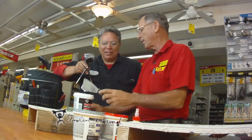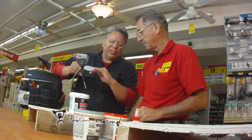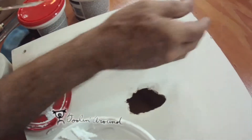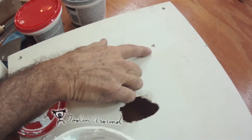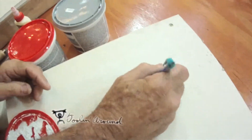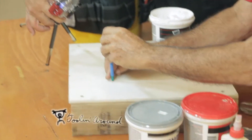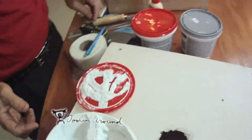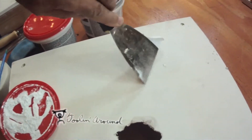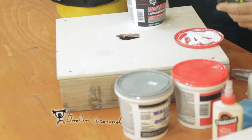If I was to go ahead and patch that hole, it would be a poor job. Because when the screw was removed, there is loose paper. What is recommended is that you cut off as much as you can, but you're still not going to get a good patch. So what is recommended is taking a pencil — a leaded pencil, or even a pen — and push in on that puka. You're recessing the paper into the drywall. Then, when you take your putty knife and your spackling, you get a nice even fill. Because this is the anti-gravity type, you're not going to get any drooping.